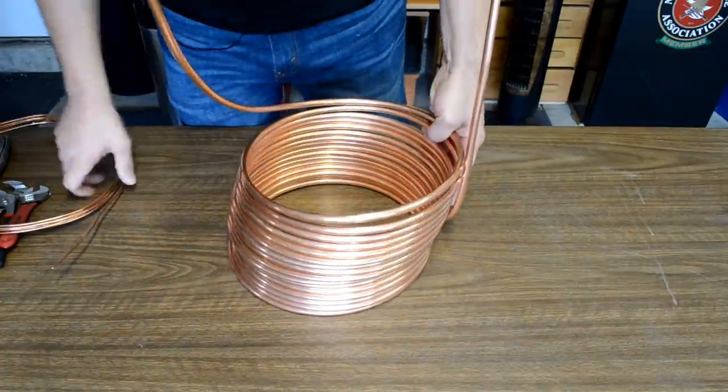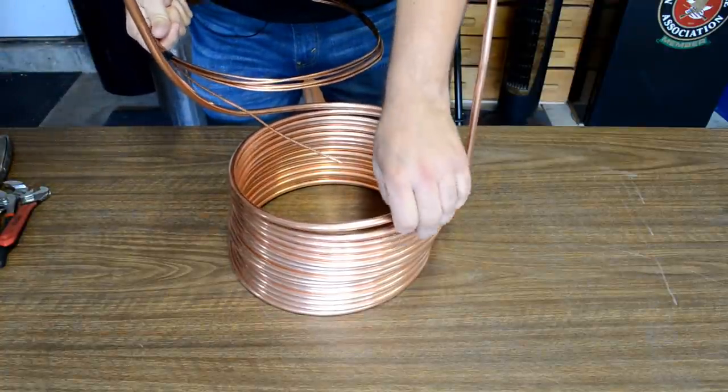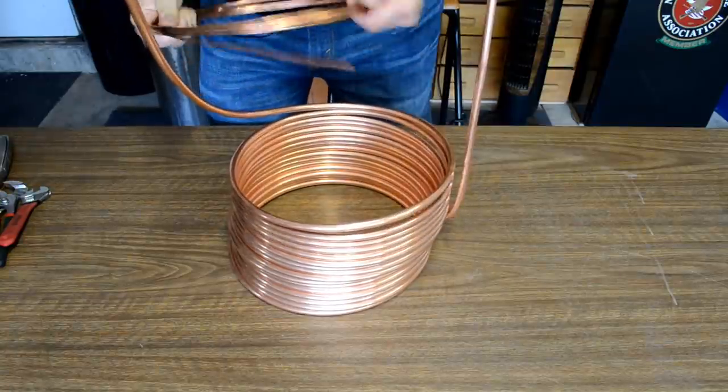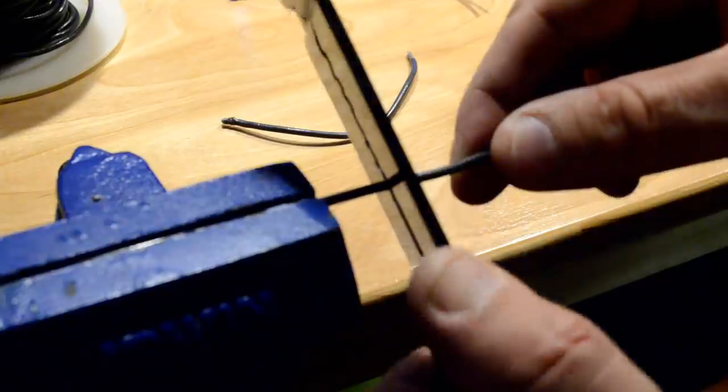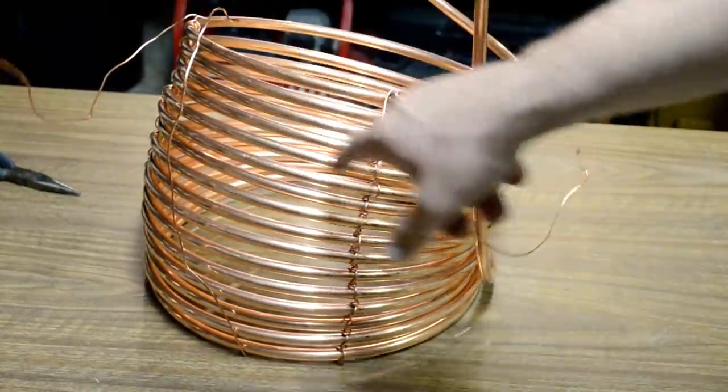And to do that, I have this bare wire that I bought that I'm going to weave in some fashion between the coils, in a manner I have yet to determine, to space them out a little bit. The original wire gauge I bought for this ended up being too big in diameter. It was very hard to form and bend and twist and navigate through these coils, and I ended up discarding that idea. I went and found some used insulated wire I had on hand that I just stripped the insulation off of, and I was able to use that much more effectively.